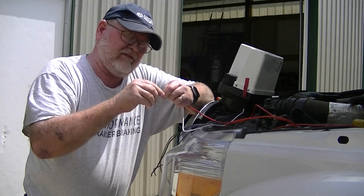Put a quick wire nut on it. The pump actually has two different sets of operations: one is the breakaway side and one is the operational side. To test the operational side, it's pretty easy — you take the black wire and connect it to the positive on your battery, then follow with the blue wire, and you can see that the pump is actually running. That's the operational side.